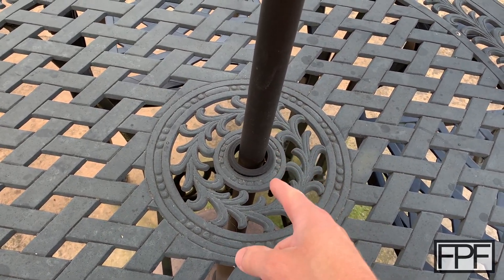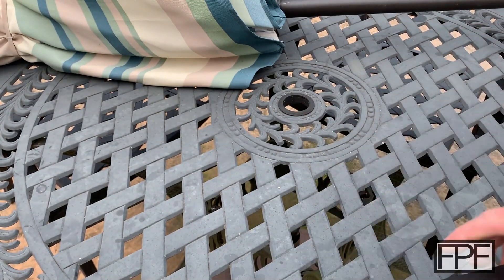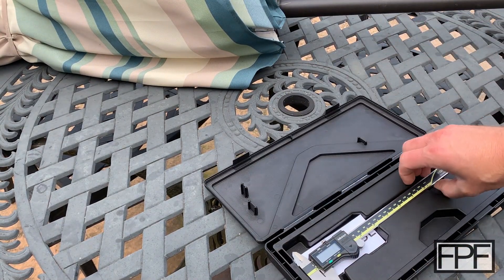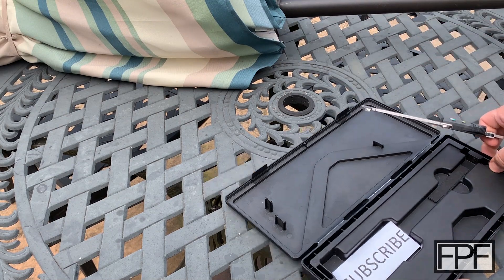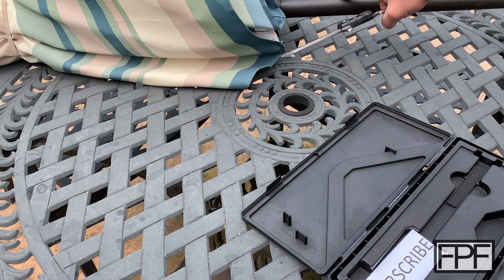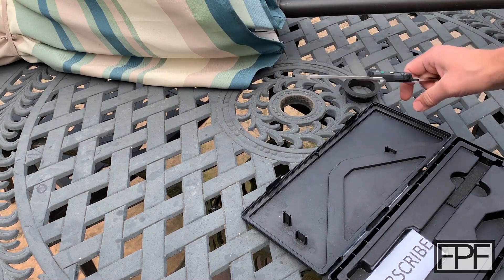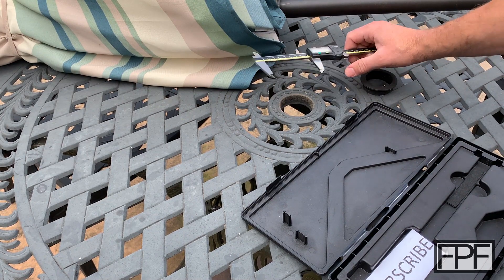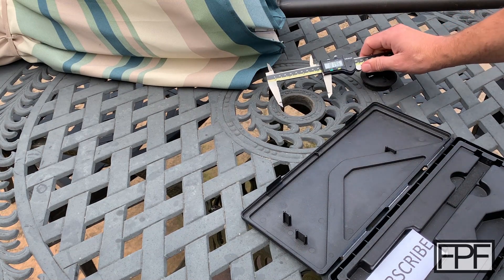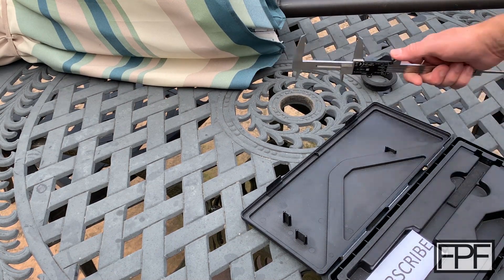Let's measure and design a piece to fit. I always have my 200mm caliper in my pocket — what, you guys don't carry one of these? I like to use a caliper not only for actual measurements but also just to help estimate. We need at minimum the outside diameter and the inside diameter. I want some overlap, so I'll estimate the OD should come out just to the edge of that first decorative ring — we'll call it 75 millimeters.